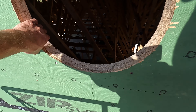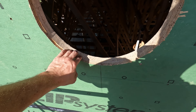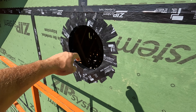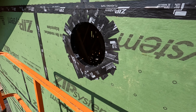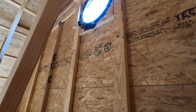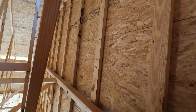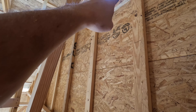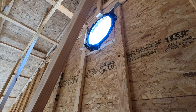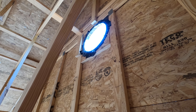I got my housing in there and screwed it off. I'm going to take that zip tape and wrap over it — got it taped off, covering all my exposed edges. If any water were to get in behind it, it can't get down into that exposed material. Now let's go in and try to hang the fan. I went ahead and screwed three screws around the bottom side so hopefully I can set it up, it'll sit on them, and give me time to get a screw in the top. This is probably not what you'd call the safest maneuver, but you gotta get it in there.